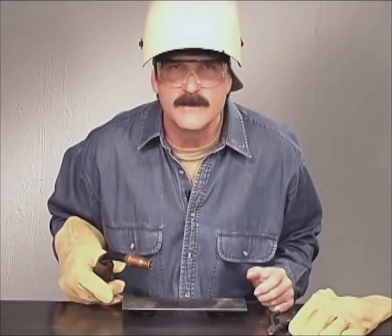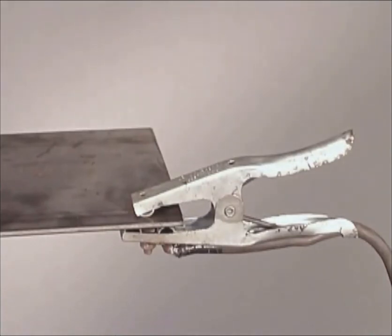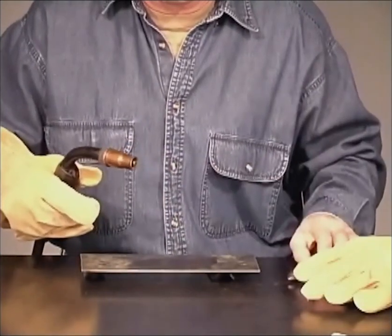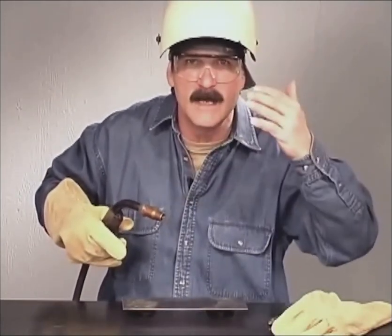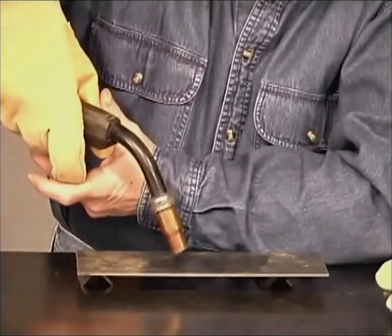Ideally, the ground clamp should be attached directly to the metal you are welding on. That's not always possible — sometimes it's clamped to the work table — but because of the relatively low voltage, it's important to have a good clean ground. If the wire sputters at the beginning or during the weld and the arc seems like it doesn't want to stay lit, check the ground connection. To start the weld, trim the wire so the gun can be held close to the metal. Steady yourself by using both hands on the wire feed gun with one arm supported. Move your head in close to be able to see the molten weld puddle. When you are comfortable, either reach up and slide your hood down or flip the hood down with a nod. Then pull the trigger.